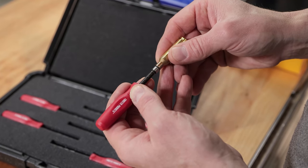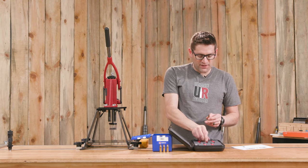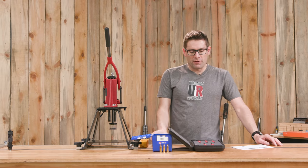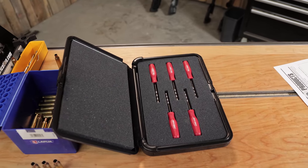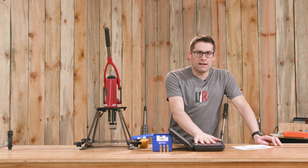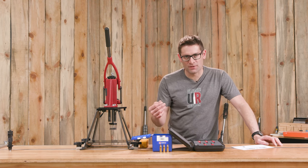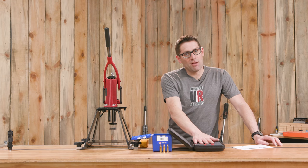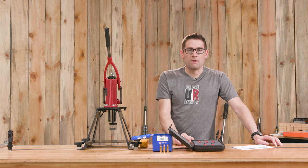So we know this inside diameter of the neck is between 262 and 263. And based on our preference for what we want for bullet neck tension, I think that's going to be just perfect — about one thou of interference fit. You can use this to examine brass that you've got, or as part of your reloading process to make sure you've got the appropriate neck tension. It's going to be more consistent and give you a better result compared to trying to use digital calipers on the inside. This gives you the feel and it basically emulates what the bullet does when it goes into the case neck — that cylindrical bearing surface on the bullet.